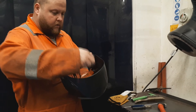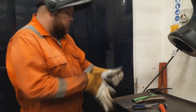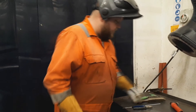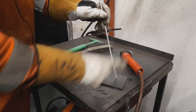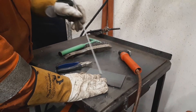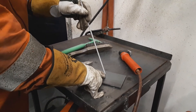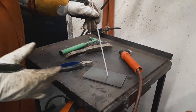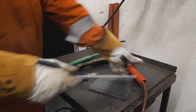We're going to do a simple bead on the plate. Angles of slope and tilt are quite important. From a health and safety point of view, when chipping your slag off make sure you've got your mask down or are wearing safety specs — if it pings off and gets you in the eye it will burn you. Our angle of tilt, which is side to side, we come in at 90 degrees. Our angle of slope — we always drag with MMA — so we drop back from 90 to about 80 degrees and drag down the material. Arc length wants to be approximately 2 to 3mm; too close and you'll choke the arc and get slag inclusions. Keep a nice consistent arc length and keep feeding the electrode in as it burns away.